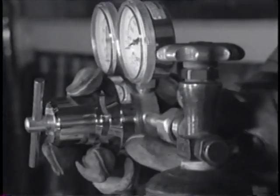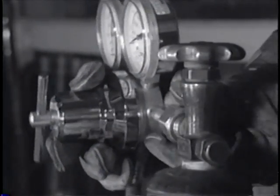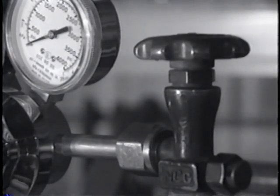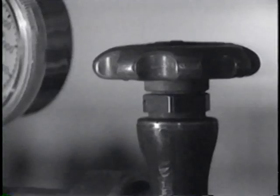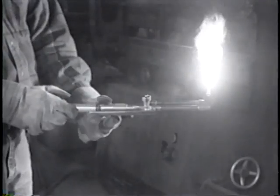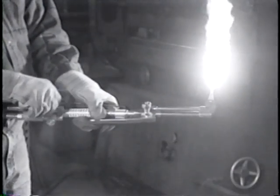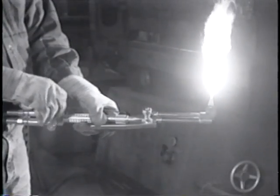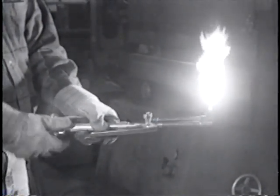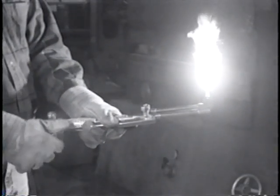After he got another cylinder of oxygen, he put the regulator on the new tank, but still without shutting the regulator off. Before resuming the job, he took a break and didn't open the valve on the oxygen tank. When he came back, he forgot he hadn't turned the oxygen on, so he went over to his torch and made mistake number three. He didn't purge the line. If he had, he would have realized that he didn't have any oxygen pressure and that he had forgotten to close the oxygen valve on his torch.